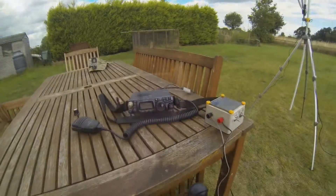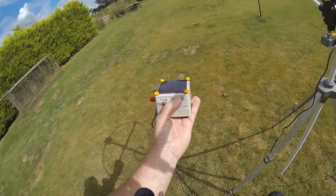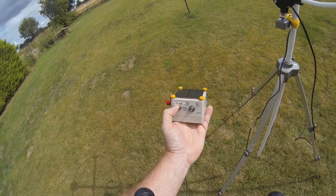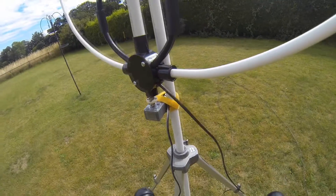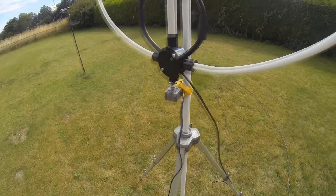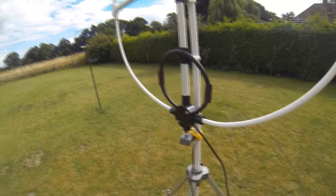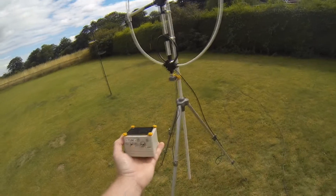I'm going to show you how it actually works. This dial switches the speeds between 0.6 RPM and 1.2 RPM. This basically changes the polarity from positive-negative to negative-positive. Because it's a DC motor, it turns the rotor and swaps the rotation - so you can turn it one way and then just push the button the other way and it will turn the other way. It goes slow enough at 0.6 RPM to be able to fine tune on any of the bands that the loop covers.